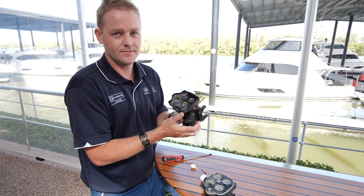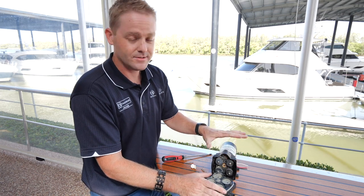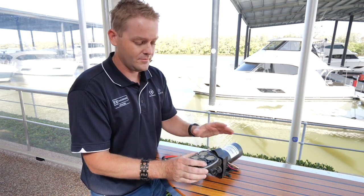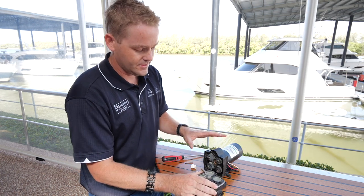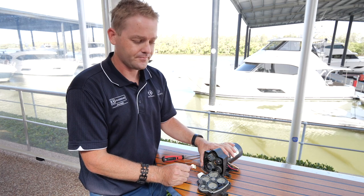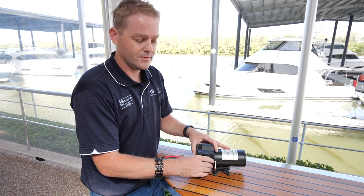The pressure switch is on, the motor's not running, there's no water flowing. And that is the most common fault that we ever see in any brand of fresh water pump. You can go to the extent of buying a rebuild kit, but quite often at this point you don't know what else the water's got into. You're better off buying a new pump.